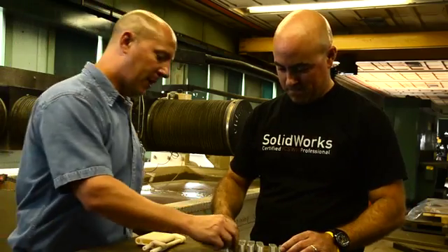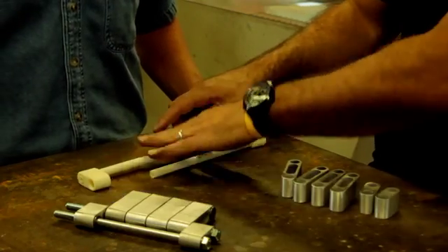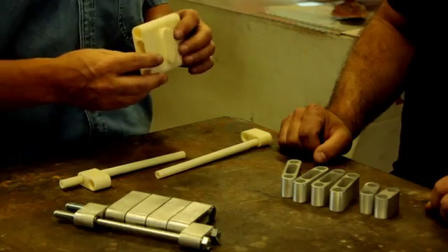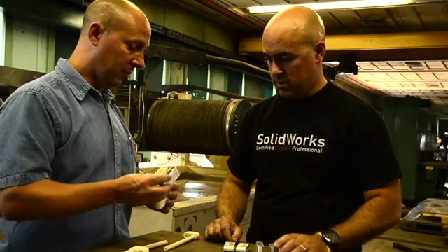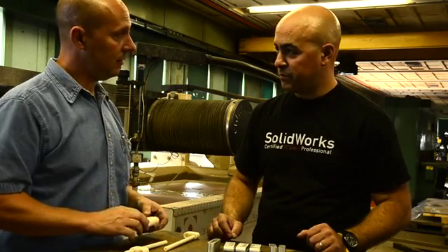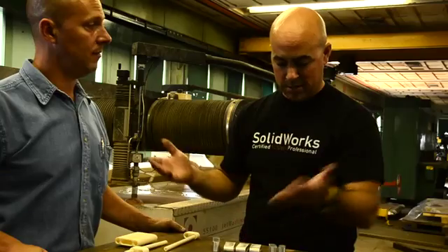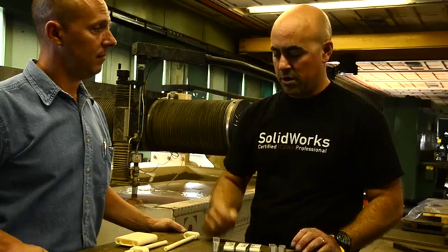Jeff shows us the parts that just came off the water jet. When I originally designed the shoe plate, it was one piece, four inches thick — which that machine can handle. But the problem was time and cost; it costs a lot of money to cut a piece like that on the water jet. Seeing how I did this in SOLIDWORKS, we could easily break it up into individual components, making it very cost effective. Not to mention a four-inch thick piece of aluminum costs much more than a one-inch piece. Once we put it all together and press in some bushings to help with the friction of the tracks, I love the solution. Jeff's advice helped fix the design and it turned out even better.